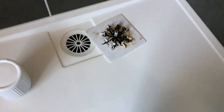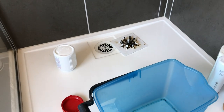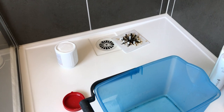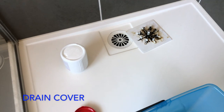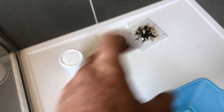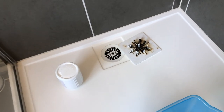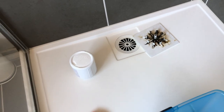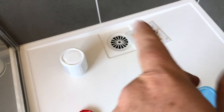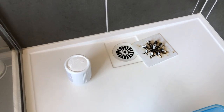We're going to leave that for 20 minutes, then come back and run a great heap of hot water down there, and hopefully that'll clear the blockage. You can of course also check mechanically — that drain is actually really hard to get out, but you can get a piece of wire and stick it down to hook any hair or solid matter. But hopefully we're just going to do the easy way and use a whole container of caustic soda — four bucks, it's worth a try.